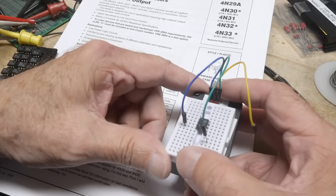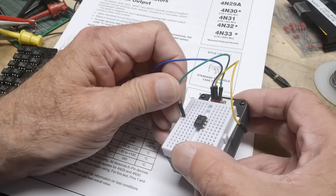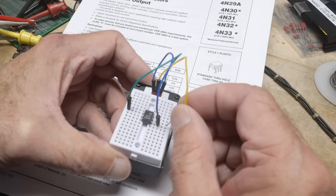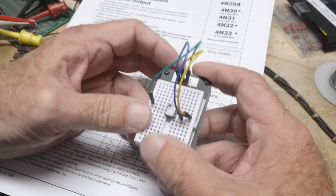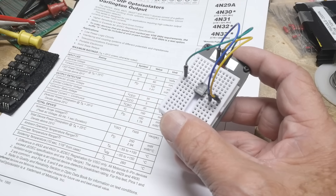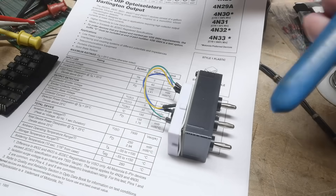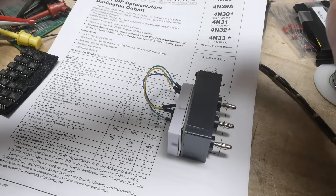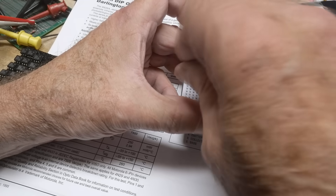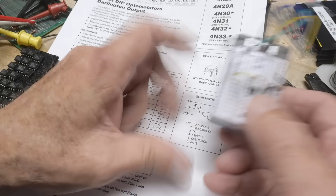The base is green and goes to the LED. The emitter goes to pin 4, collector to pin 5. I need a little jumper wire to connect them. The emitter will be our ground, connected over to the LED side to allow it to turn on. Let's put this on the curve tracer.